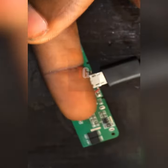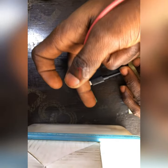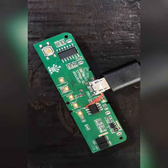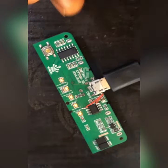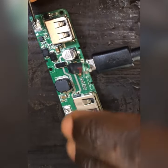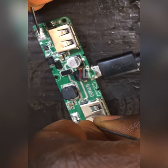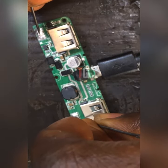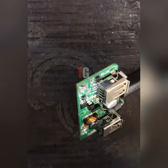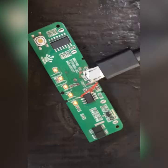I'm just trying to feel the board — nothing is getting hot, so it's okay. Now you can see the light is on. Let me check the voltage — let me turn it the other way around. That is the output from the battery connector. Let me check — we have 5.13 volts which is very okay.